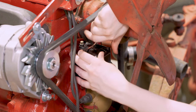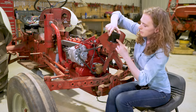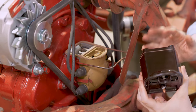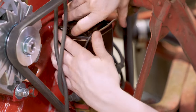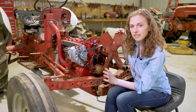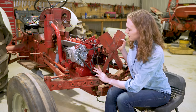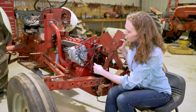Your next step is to change your coil from 6 volt to 12. The bail will slide right off the front and you can remove your 6-volt coil — six volt coils are typically black in color. Take off your old gasket, put a new gasket in place, and your new 12-volt coil is ready to go on. This is a 2.5-ohm coil, and by changing it out you make the system really simple and clean — you don't need an additional resistor beyond the one that is your terminal block behind the dash. If you want to tune up your distributor while you're at it with new points, condenser, cap and such, we have a separate video showing how to do that.